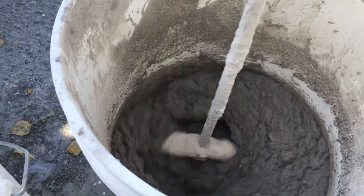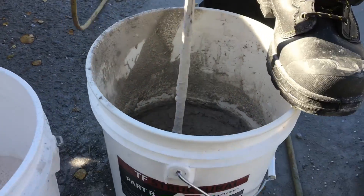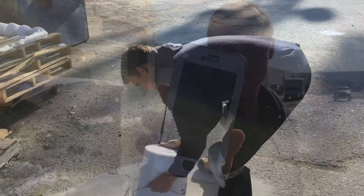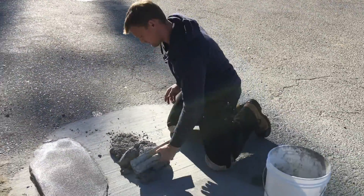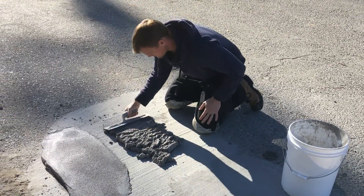Add a little bit, see what kind of difference it makes, and then go from there whether you reduce or increase the amount. You just dump the powder right into your bucket as you're mixing. Mix it up for a good 30 to 45 seconds to make sure it's evenly distributed. We made our next mix using the TF Heat — the time now is 10:58. After you have added the heat to the mix, it is important to get the product out of the pail as soon as possible as it does cure a lot faster in thicker volumes.